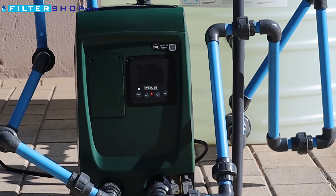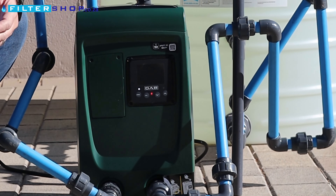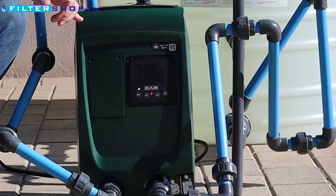One of the nice things with this pump is that you've got a display which covers a lot of information. You can set the pressure like you can on most VSD pumps. This is a 0.75 VSD — there are two specs: the incoming power and the actual usage power. What's really nice about the Easybox range is they actually tell you the power consumption on the screen.